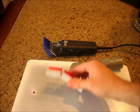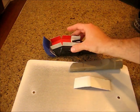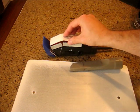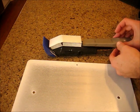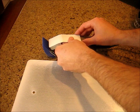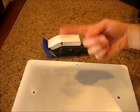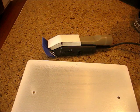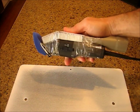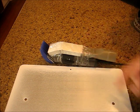If you have the ability to cut and bend sheet metal, this is the best solution. Make a little bent track like that with a lid like this so that your crevice tool shoves in, and that'll route air directly to the crevice tool, and then you can just tape this whole thing together. This is what it should look like when you're done. Get the suction as close to the blade as you can, and if you're careful, you should be able to avoid the switch while you're taping.